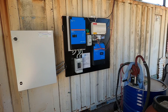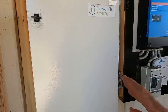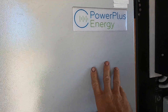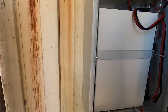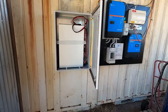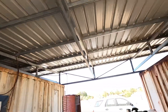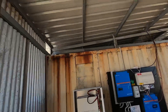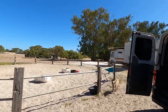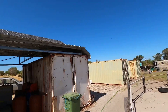I replaced it all with Victron stuff. What we're doing here today is I've just upgraded their batteries. This is a Power Plus Energy battery cabinet mounted to the side of the shipping container. Originally when we built the system it was built on a budget. We've got a roof between these two containers which has been really well built, and on the roof I've got about 18 solar panels with tilt kits.